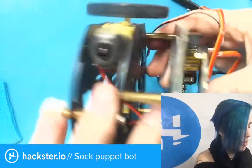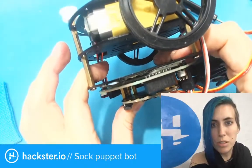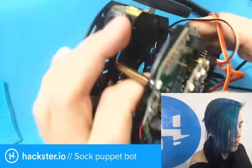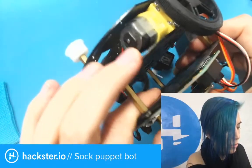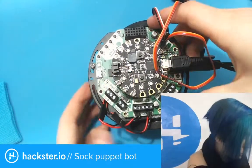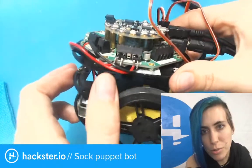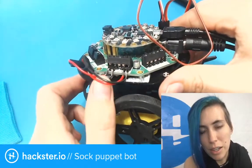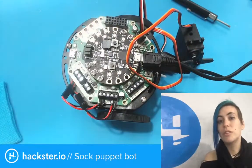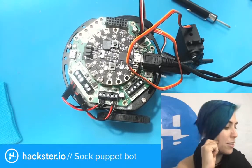To connect these two, I've just used some foam tape that sort of insulates it and gives it a little bit of separation from the base and also adheres it. That's not, you know, a long-term solution. As you saw when I pulled this up, it kind of wiggled around a bit, which is not good. I don't want things shorting out through the chassis. We've also got a slightly dangerous situation over here with the motor wires. All of that is something I would completely fix before trying to actually deploy this anywhere. But it's a good start!